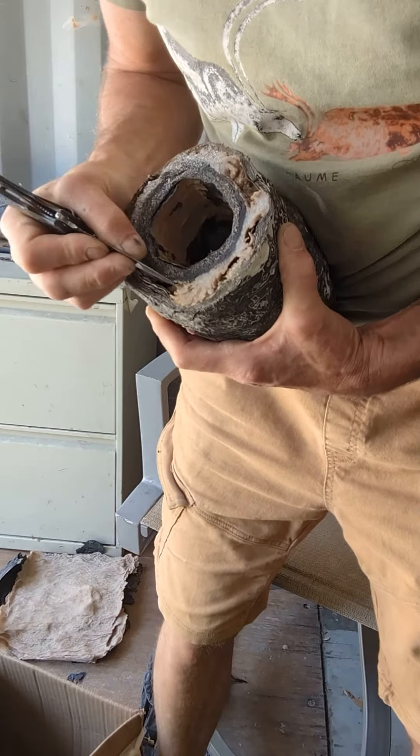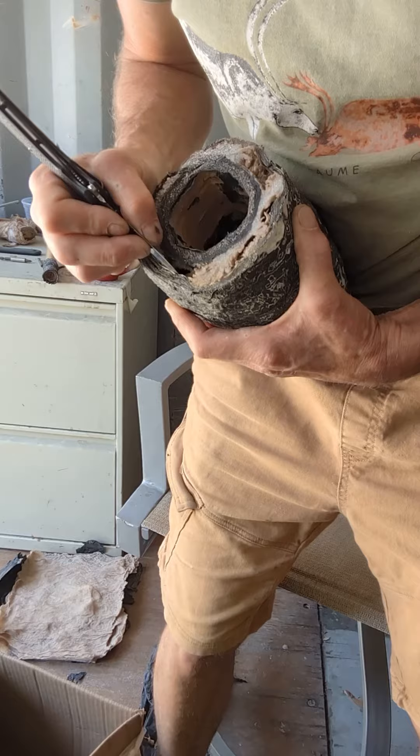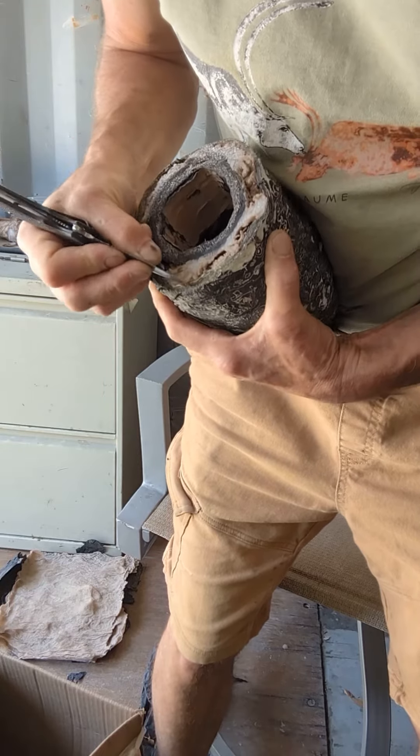Then I did some of the clear plastic and I got it too hot — you can see how it kind of melted, liquefied, and pulled apart, creating all these voids. And this one I didn't get hot enough, so in sections it didn't fuse properly.